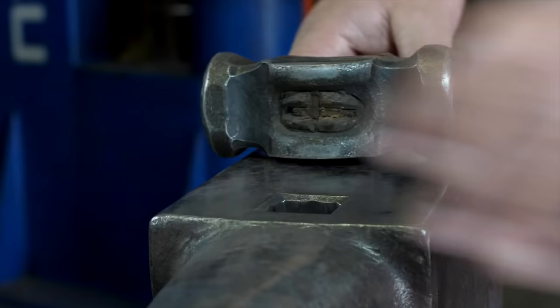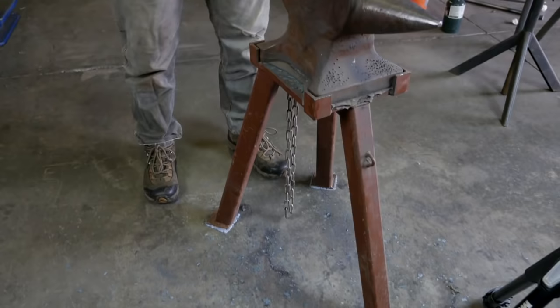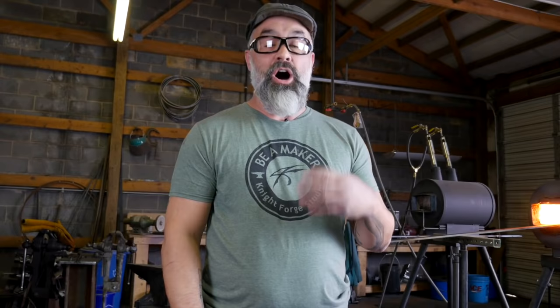That eliminates something — anvils are notorious for singing. You don't hear it singing, it's not killing my ears. The other thing is it's siliconed to the floor, so it doesn't move. If you use a stump, that's fine — bury it about three or four feet into the ground and you'll have the same effect. But if you have a stump sitting on the ground or two-by-fours, it'll bounce everywhere — works like a shock absorber. Silicone the anvil to the base, silicone the base to the floor — not moving. I've found this to be the most simple and direct way to ground my anvil so I can forge without chasing it.